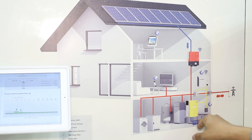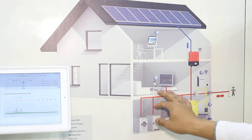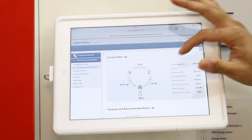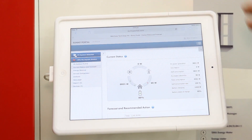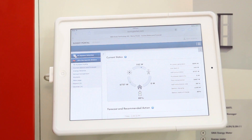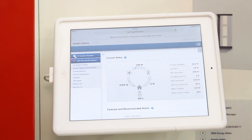When the excess PV finishes charging the battery to full, at nighttime when there's no PV anymore, instead of drawing power from the grid, we will utilize the battery power to supply the loads at night. The home manager shows you the energy flow at home in real time. During the day, we can see PV energy feeding the loads and charging the battery simultaneously, with nothing feeding back to the grid. At nighttime, when PV shows zero watts, loads are first supplied by the batteries, and if the battery is drawn down to a certain degree, we draw power from the grid once again.